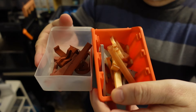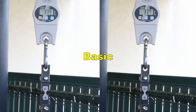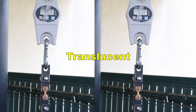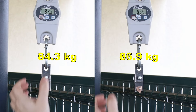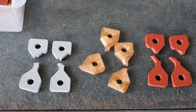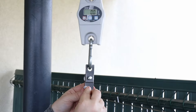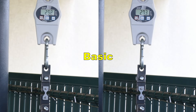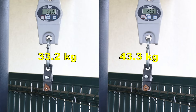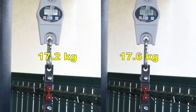The objects are ready for mechanical testing. Starting with the tensile pulling test with horizontally printed objects, beginning with the basic: a little bit over 60 kg. Translucent: over 85 kg — much stronger. Carbon fiber version: approximately around 60 kg. Interesting to see different break patterns but equal results for one filament type. Next, the layer adhesion test with vertically printed objects. Basic shows good layer adhesion for PETG. With the translucent I got quite big differences in results so I will repeat part of this test, but let's check the carbon fiber — and this is too big a difference. Everything below 20 kg is not acceptable for me.